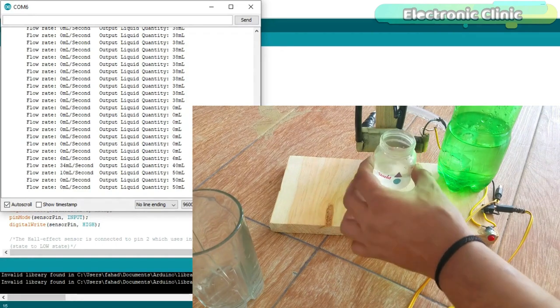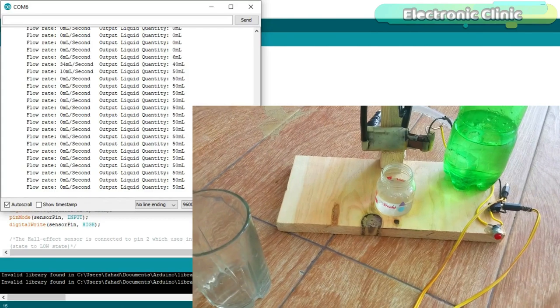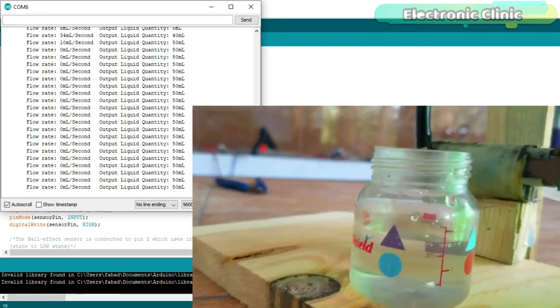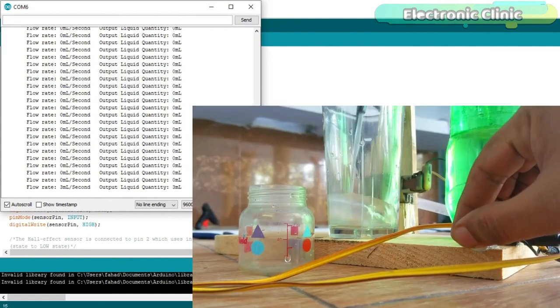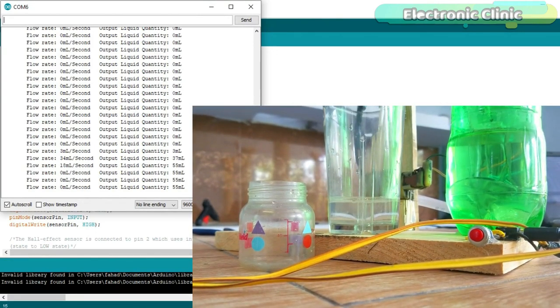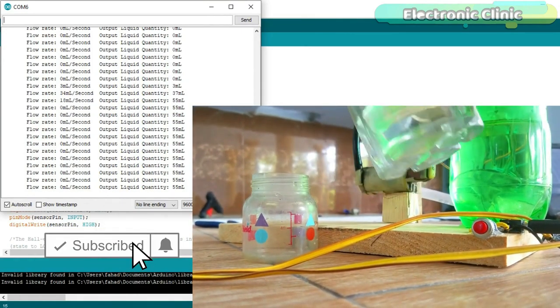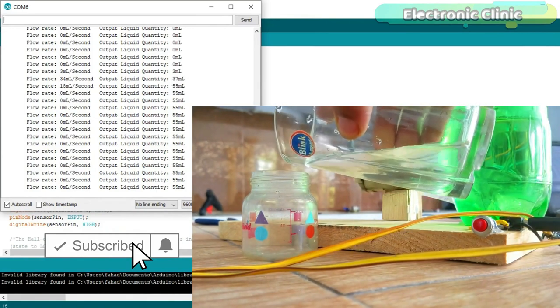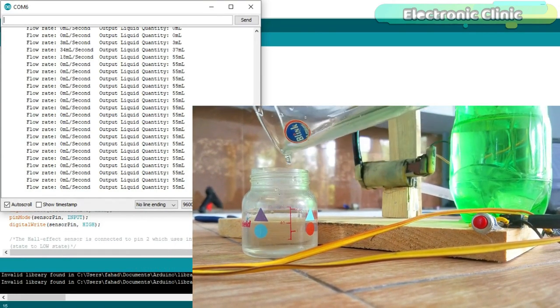As per the data sheet, when water flows through, the rotor rolls. Its speed changes with different rates of flow. If we can keep the pressure and flow constant, we can make an accurate water volume measurement system. I solved this problem by using a 12-volt water pump. As you can see, each time I press the push button, I get the same water flow and pressure.